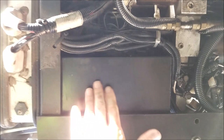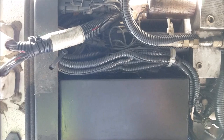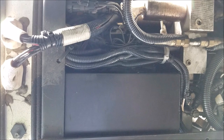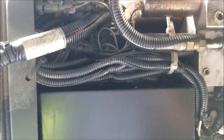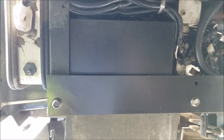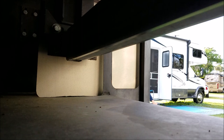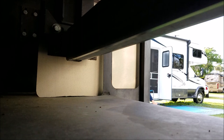I've cleaned it up some, but on top of this tank and underneath all these wires it's still a filthy, dirty, gritty mess. When I get home my plan is to get some good degreaser, soak all this area really well, and get it dried up. One last step before we leave is to raise up the jacks, bring in all the rooms, and check the oil level. I'll open the storage compartment door and access that dipstick, being very careful not to allow any dirt or grit to fall in. All in all, I think this project is taken care of - no more leaks. Thanks for watching and have a great day.